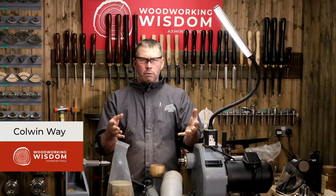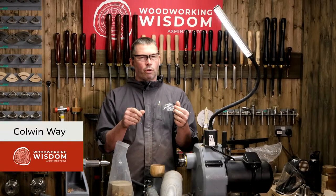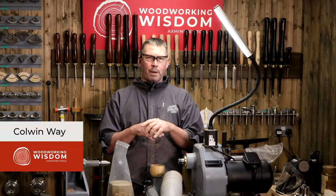The reason being that green oak is one of those timbers that needs to be treated with a little bit more respect in terms of its tannic acid content. It rusts anything it touches. If it's not made of stainless, for instance, it'll blue your hands and rust your tools, all those sorts of things. I just wanted to talk about that because it catches quite a lot of people unawares, and it's not the only timber. So we're going to talk about that as we go through it.